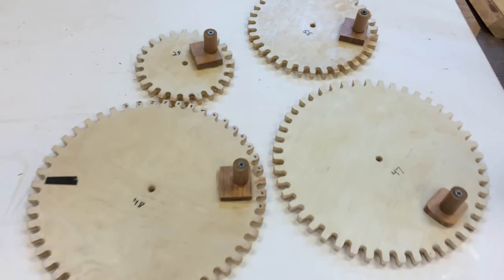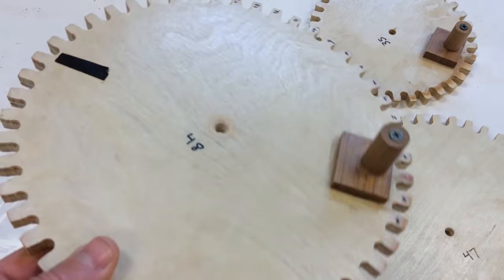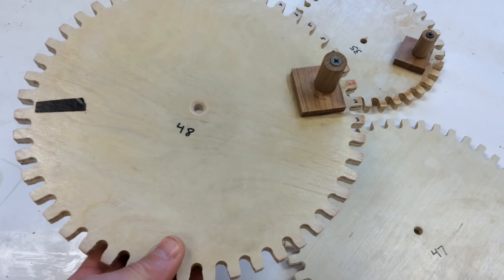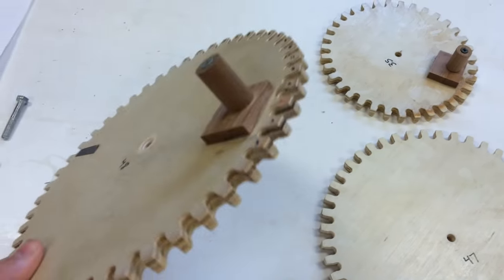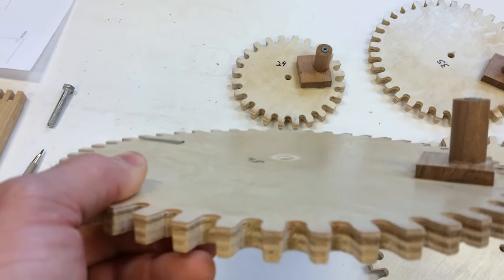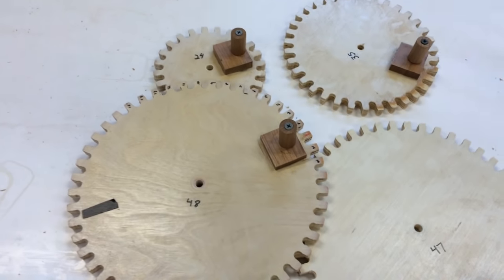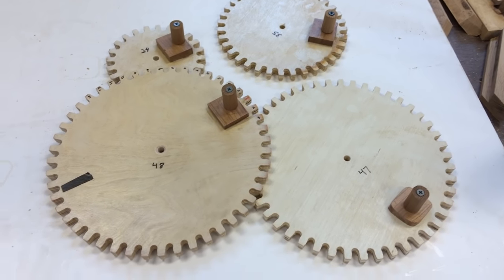As far as making gears, it's really not that big of a deal. Here are some that I made — I've had no rejects. The first one I made worked fine and they've all worked fine. The 48-tooth gear, of course, the more teeth there are the longer it takes, but my first try might have taken me half an hour, plus a little extra to put sealer on it, and it works great. Don't be intimidated — just because you've never made gears before, it's not a big deal. Just get some decent plywood and a bandsaw and cut them out.